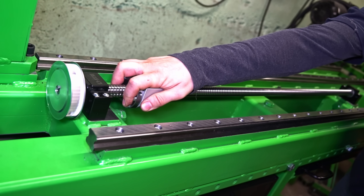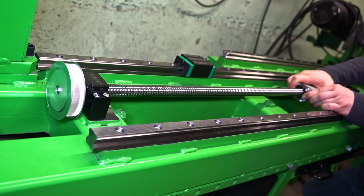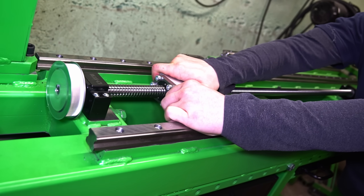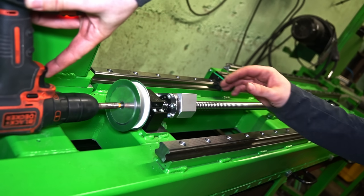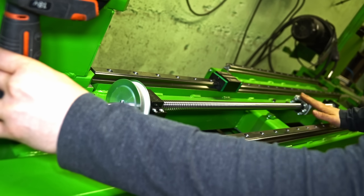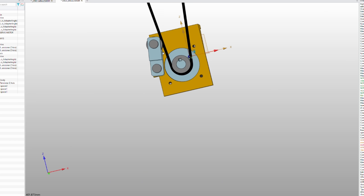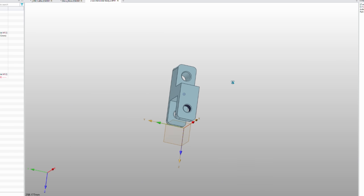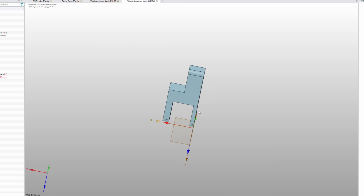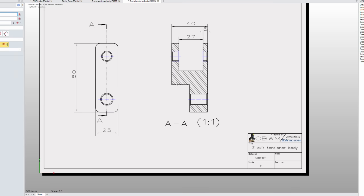Here's the non-self-locking nature of ball screws — it's something beautiful. Now the design of the axis drive: it consists of the motor and mount, the pulley with a belt and a tensioner. Heading on to the tensioner.